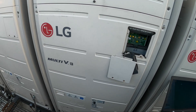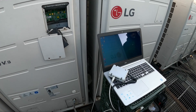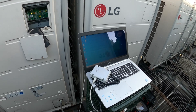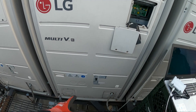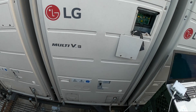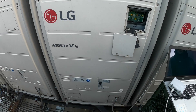The purpose of today's video is to save and record data, save the report, and send it to the local rep along with the refrigerant charge — 440 ounces pulled out and put in last time. Tech support could not help me. What's going on is that this new compressor is running on very high amps, anywhere from 25 to 30, and we've even seen it go above 32 — at one point even 36 amps.